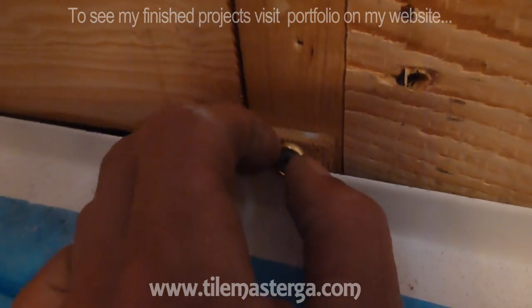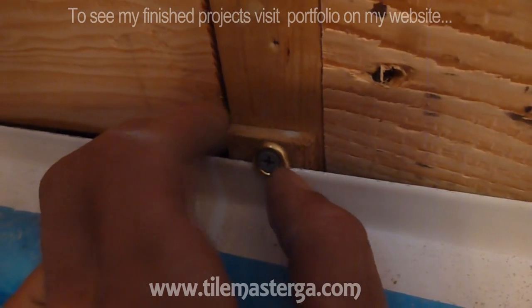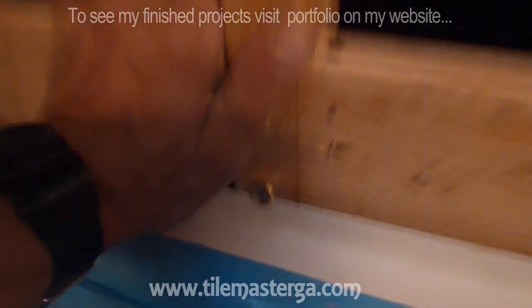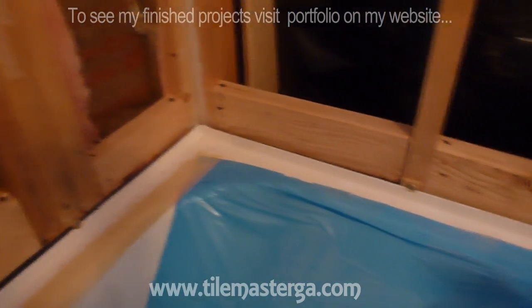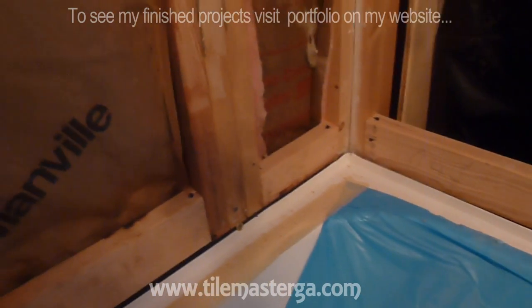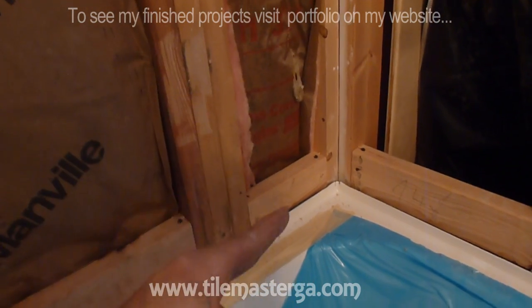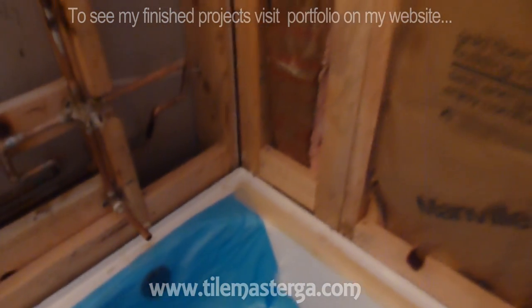In our case, we had to adjust that slightly, and this is why I'm telling you about it, to not lay the board just like that. Okay, let me move forward with the first piece. I'm gonna start from the back wall. What I will do, I will apply liquid nails on the studs, on the bottom roll, to ensure good bonding and durability. And this is something to come in a few moments. So stay tuned and you'll see how this part is done.